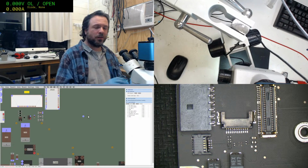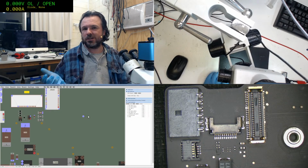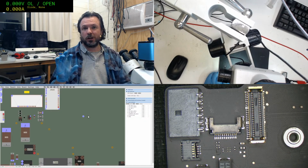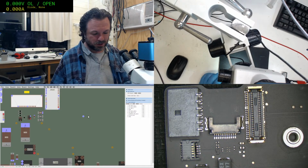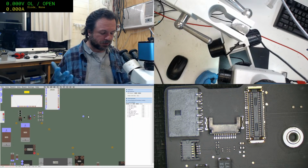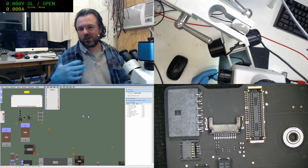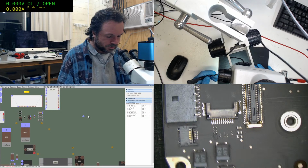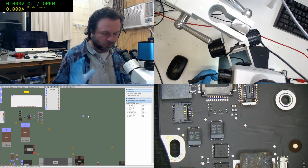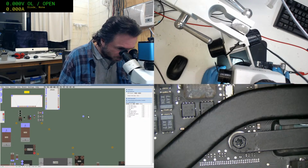Okay, you've had almost the same values. Alright, it depends on what you're measuring. If it's a strictly resistive network, then yes, you will get that. It will be the same either way. But on boards like this, generally speaking, there's enough protection diodes and semiconductor and other diode influences going on that it is generally easier to do it with the ground on the bottom, and you will get different values whether you go positive on ground or negative on ground.